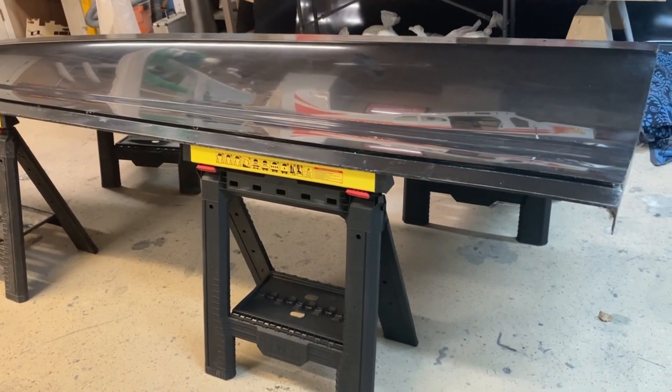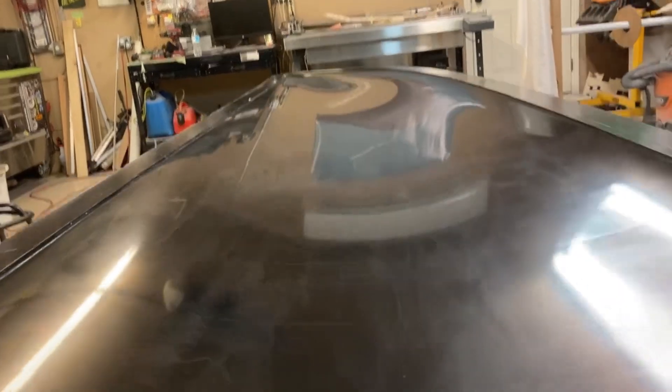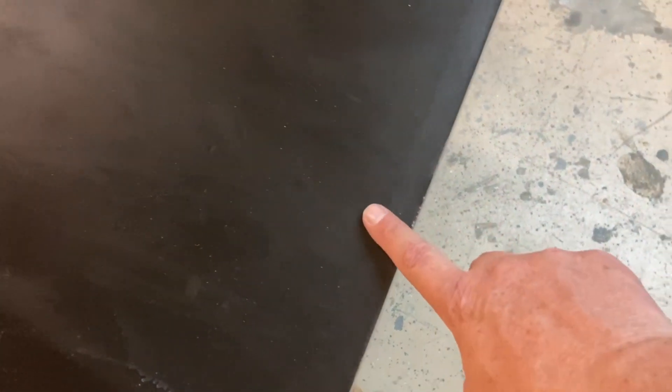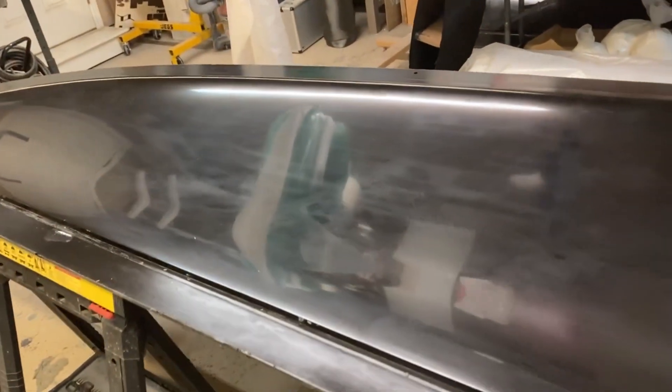This allows me to move forward a little quicker. These molds are straight off of the plug — no polishing done yet, and honestly I don't think I'm going to polish it. I'm going to sand a couple of small spots — there's a slight ridge right here — but I'll just take that off. Then we can lay in the tape for the joggles in the center where the wings join, and along the leading edge there'll be a joggle as well. Let's get to it.